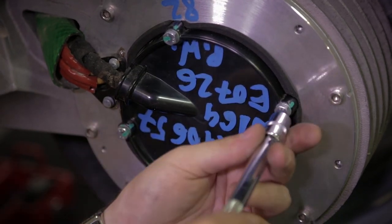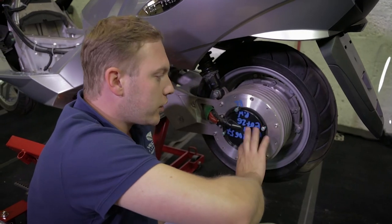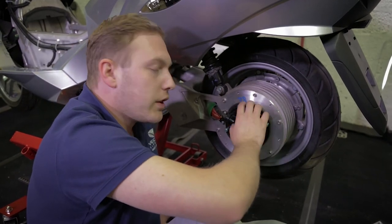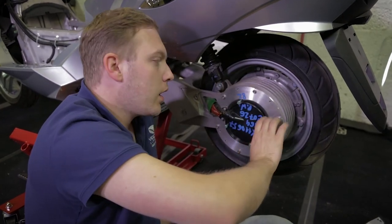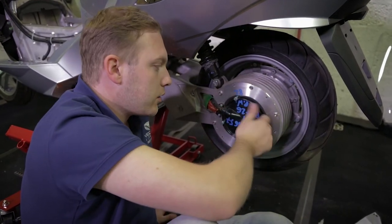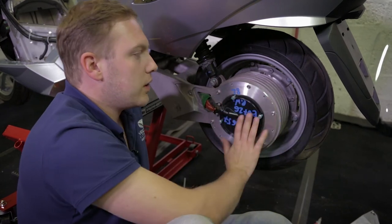In general, we recommend every 25,000–30,000 kilometers to check the encoder chamber, to be sure that the encoder is clean. Some dust or wear of the gasket edge may create small powder that can dirty the surface a little bit. In most cases, it's possible to just clean it using a compressed air spray to remove the dust, without pointing directly at the disk, to be sure it doesn't get bent. Then seal it back.